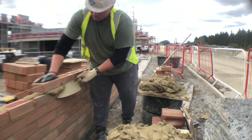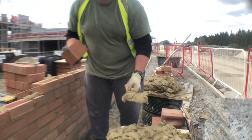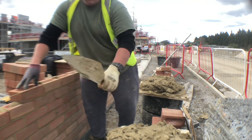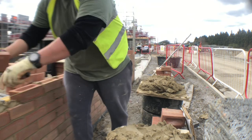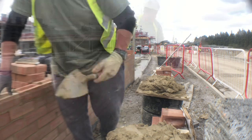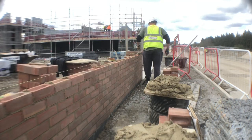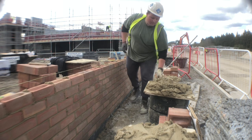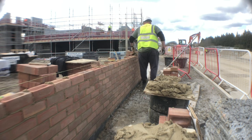Especially if you're not setting out the boundary wall yourself — I set this one out, I did the footing for it. This was originally going to be a staffed feature blue-and-block rendered wall. As you can see in the bottom left corner of the video, there are blue engineering bricks underneath. I set that footing out, built the footing, and initially set the wall out straight — but it's a series of squints, so the walls are set at three separate squints.